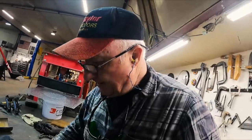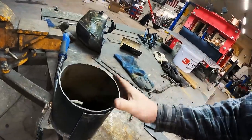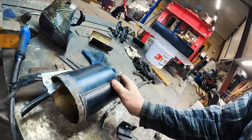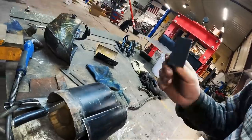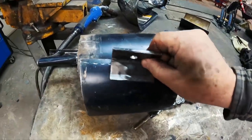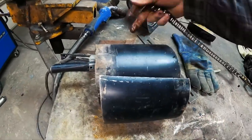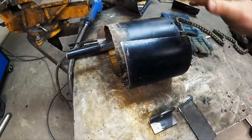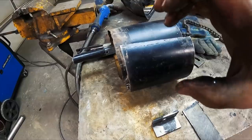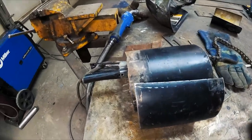Okay, I have half of a 6-inch tubing cut for the cradle. So what I'm gonna do is weld this onto the face right here. And then this chain with the bolt welded on it is gonna wrap around, and I'll weld the chain on the backside so that it can cause compression when we tighten the chain up around the existing auger.